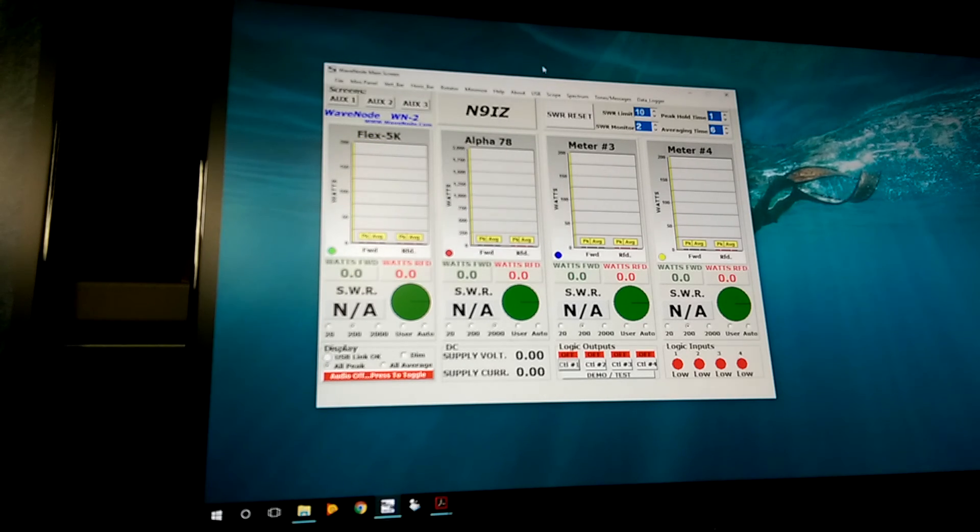I saw a maximum of about 190 watts right there doing tune-up. We're on 20 meters right now, and again close to 200 watts output. Playing around with the carrier level a little bit, and we'll switch to upper sideband and mess around with the carrier and see what we can get. November 9, India Zulu — this is N9IZ, testing, testing. There we go, we're getting good power output now. Testing into the dummy load — we're seeing a low level at the moment, adjusted up a little bit, and there were easy 200 watts. No problem on voice peaks, 200 watts out, 20 meters into the dummy load.